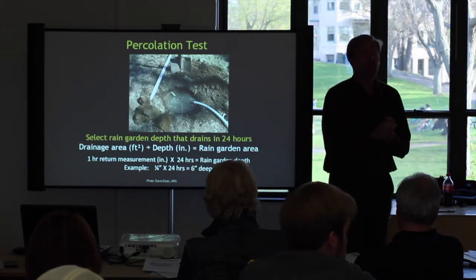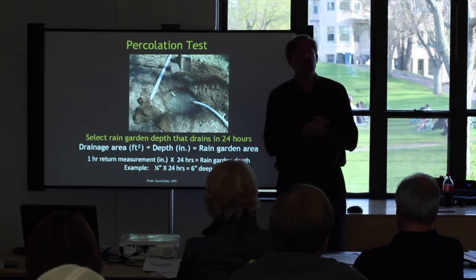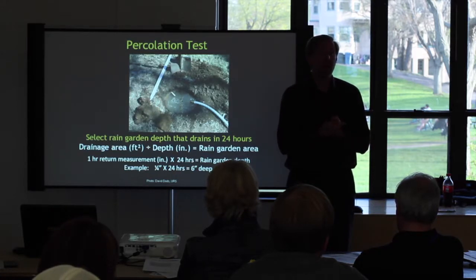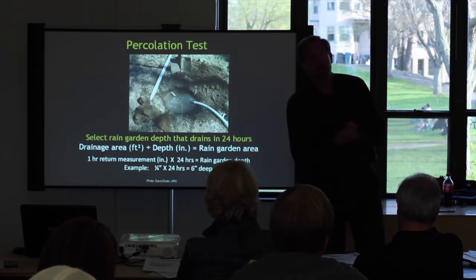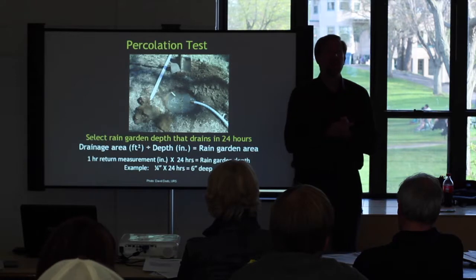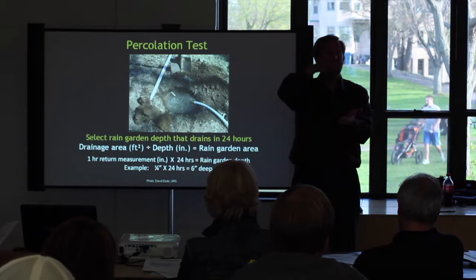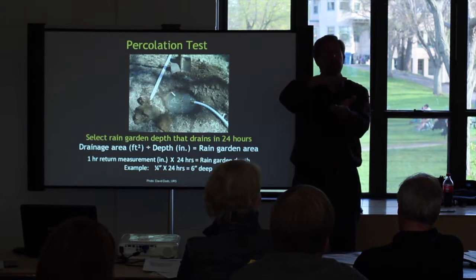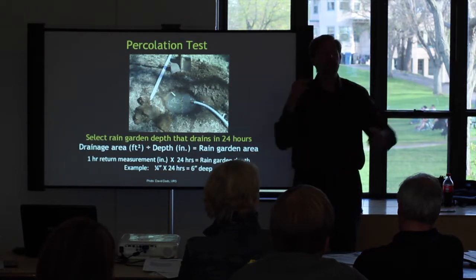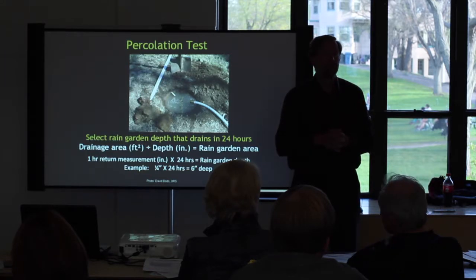I am going to assume the sump pump runs pretty quickly and more often than you wish it to. So you're going to assume that you're almost creating a wetland type rain garden. So I would test the soils and make the garden half as deep as what the soils will allow. So if it's a 12-inch deep rain garden because the soils allow, I'd only make it 6 inches and make it more surface area, because you're putting more water out faster. Those sump pumps run almost 24 hours, and so you're going to take more water out. Okay?